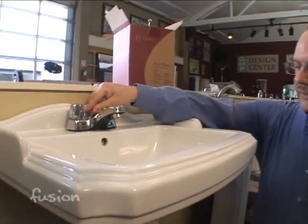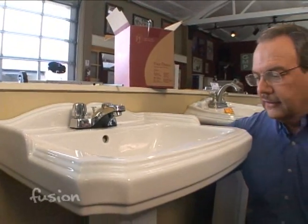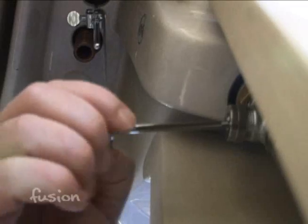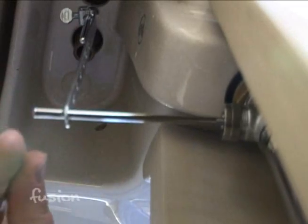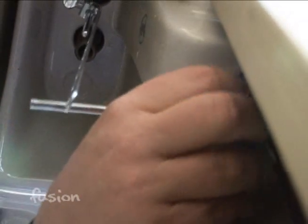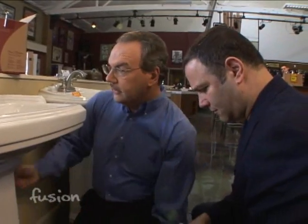And you have this little drain in the bottom of the sink called the pop-up drain, which is when you pull up on this little rod here, that's what pops this up and down. That you have to disconnect at the back. And that's, again, with sometimes a wrench, or usually you can just twist it off. And we will disconnect that, and we disconnect the little fitting at the back, too, which is pretty simple. It's just a little clip in most cases, so that all comes off.